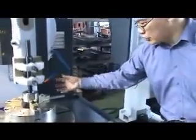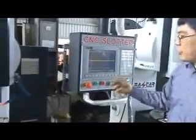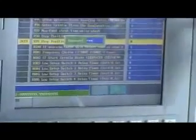After finishing, if you want the machine to come out, you can set it up in the parameter here: stop position, FY, which now is FY minus 0, so we set it outside, minus 200 millimeter. If you don't know how to set it, just use the MPG to move to where you want to stop, then memorize the value and set it up here. Enter the password 520. 520 is the machine password, then you just enter. Okay, minus. So later after machining is okay, you must come out to about here, easy to change the workpiece.